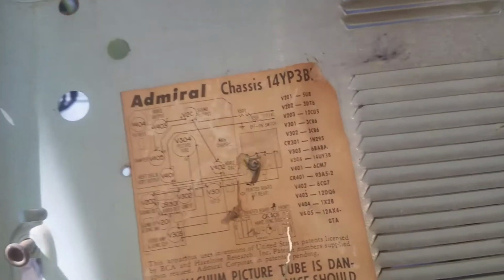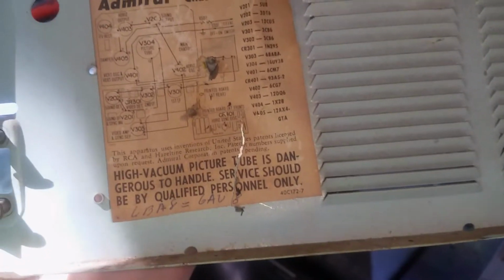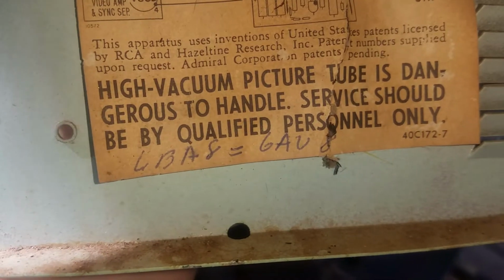I think I should get the CRT tester and get this thing tested. That's a sign that it's probably had a tube replaced on it. I don't know. But this isn't a good... Ooh. Aquadag coating is coming off of that damn thing. But yeah, CRT thing is loosey-goosey, unfortunately. What is that?